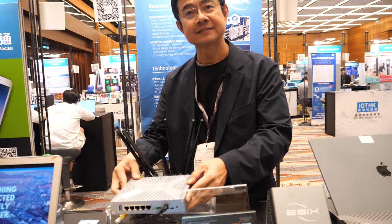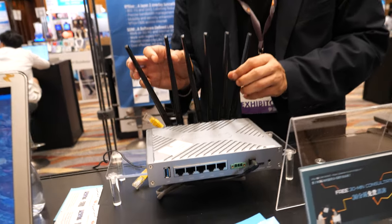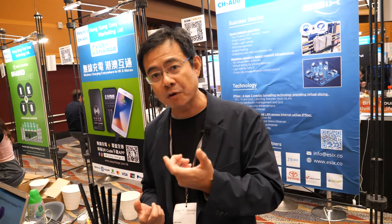It's bonding. Why do we need two 4G? There are two purposes. The first purpose is bonding — sometimes they need speed, and 4G is widely available in the world, so bonding gives them speed. The second is redundancy. Some places have one stable mobile operator and another maybe less stable. Having two operators work together makes it like a single line — redundancy and a backup solution, getting optimal bandwidth all the time.